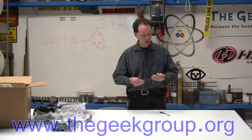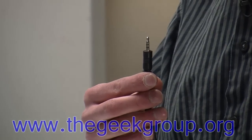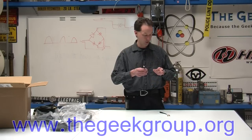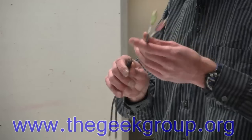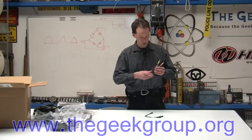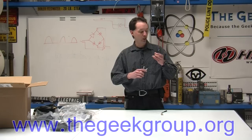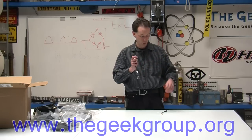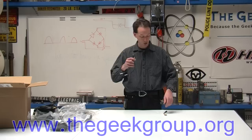And what it is — take a look at this. This is a plug you know well. That is a TRRS plug, and it goes to these two receptacles here, and one is labeled mic in and one is labeled stereo out. We also have this plug — yeah, that fits. These are a pair of TRS plugs with stereo out and mic in. This is a nifty little plug that we're used to seeing around here. This is the one we use with the camcorders. This is designed for use with an iPhone for audio breakout — to be able to use Skype and other interesting audio applications with your iPhone.